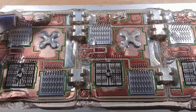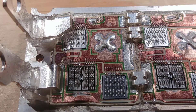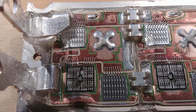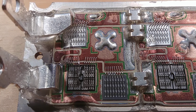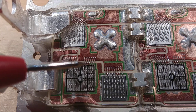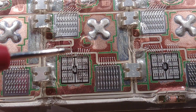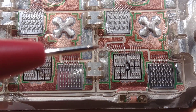That's a high-power IGBT module for you. You can see this is the pin I broke. This silicone compound is kind of gooey — you can see it sticking. It is kind of like a solid, but it's nice that it's clear so you can actually see what went wrong. Those giant copper plates in the Soliton drives carry all that current. We've got 12 bond wires there, 12 bond wires here — I think that was six on each side. So all of the current flows through just these little tiny bond wires.